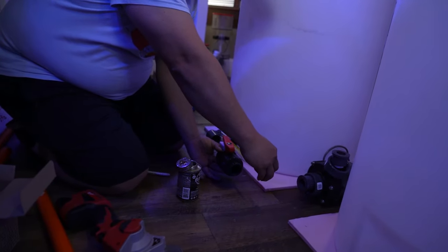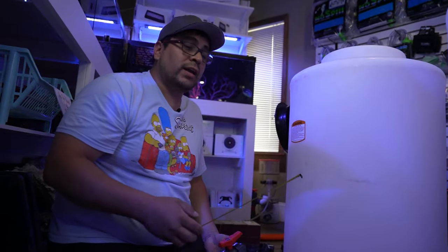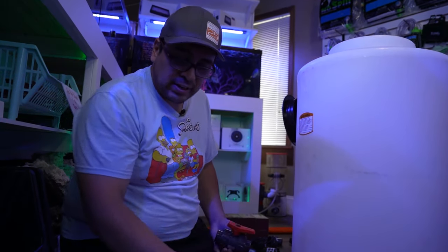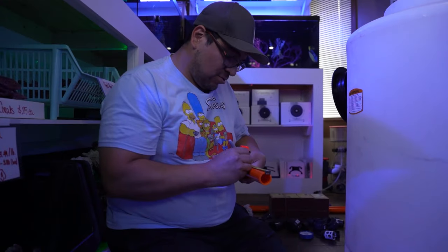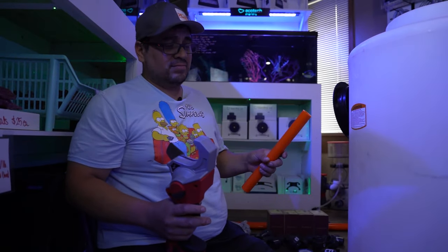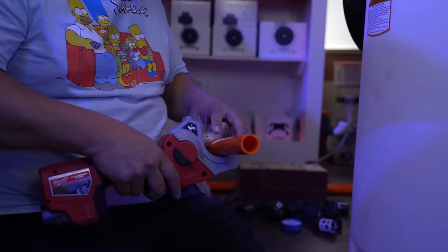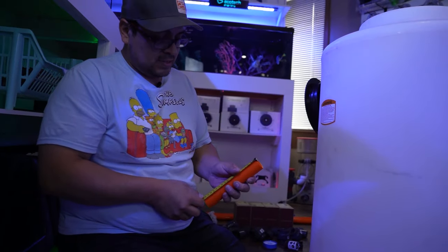In this case, I'm gonna cut a pipe with a length of about 4 inches, but I have to add 1 inch for each fitting, so it would be 6 inches long in order for me to get my 4 inches in between. So don't forget that, because if you do, I'm gonna be pissed. So you mark your pipe at 6 inches, and none of that hand doing crap. This is why we have tools now. Boom. Next one.